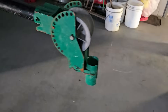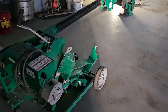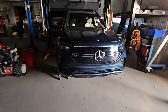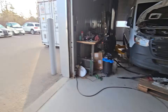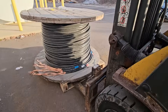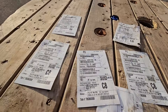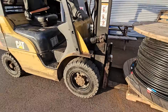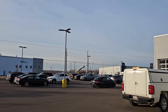So this is all the electrician's gear here. They've got a heavy-duty rope - we just call it a bull rope - and a tugger. There's already a pull line through the ducts, but they're going to use that to pull through the heavy gauge, and then that Greenlee tugger to pull through the 600 MCM copper cable - three phase, four wires per duct, a double run. That reel weighed 5,000 pounds, so they have some Greenlee equipment to mount that in preparation for the pull. That's all up to the electrician - customer-owned wire, so we're not really involved in that part.